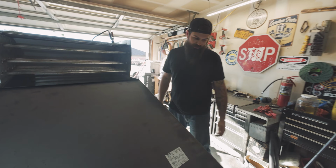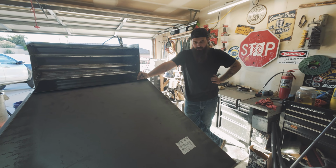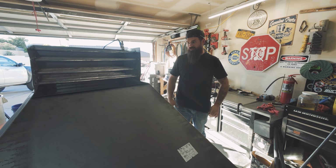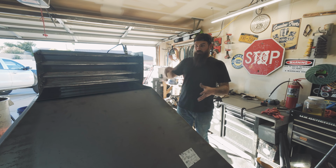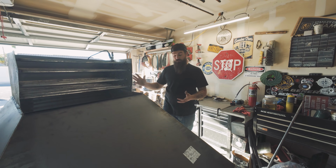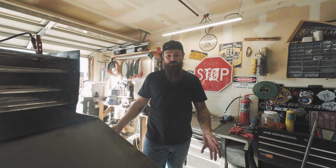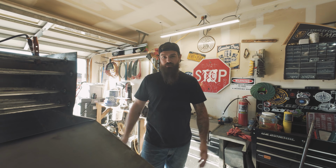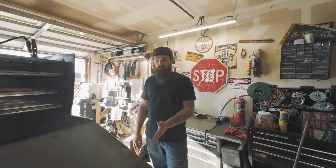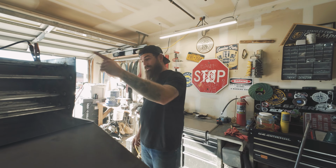And thinking about it, I was gonna use pipe for the top for the Grizzly, but instead I think we're gonna go with angle iron, just because the points of it will help break down the rock a little better, and that's the whole point of this hopper, is to get everything broken down quickly and efficiently to get everything through and washed down. We're not going to get to the Grizzly part in this video. Probably won't film that. You'll probably see it done afterwards. But that's going to be the goal for the top, is angle iron for the Grizzly bars for the feed itself. So I'm going to get to welding this, and then all that fun stuff.